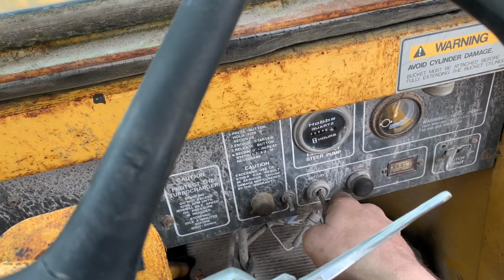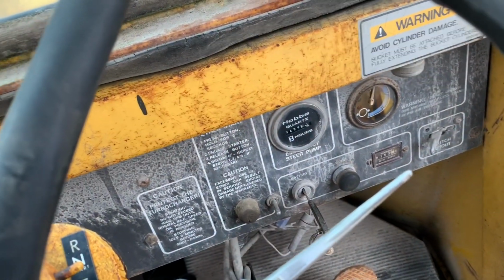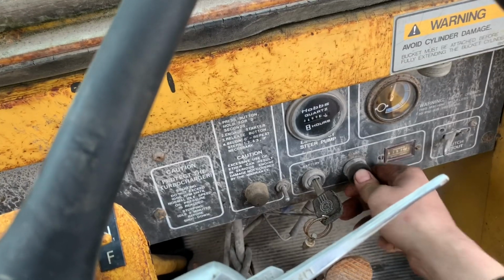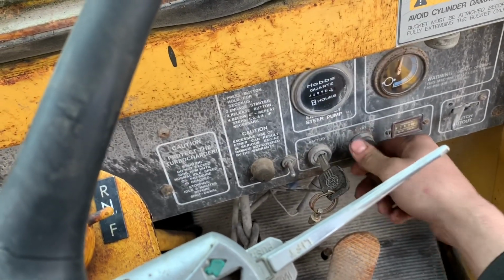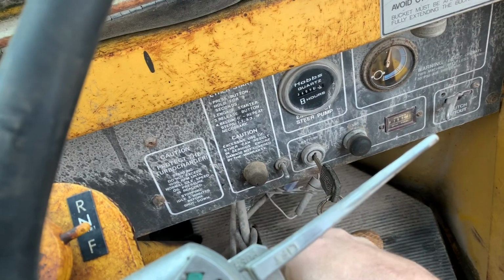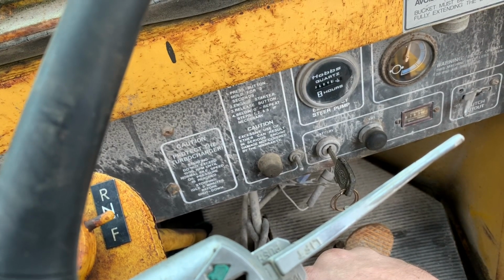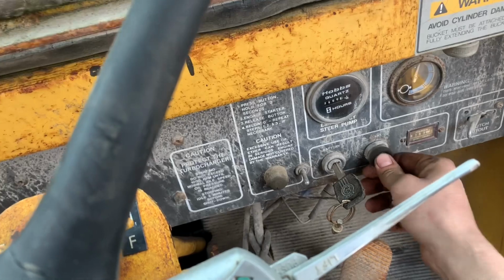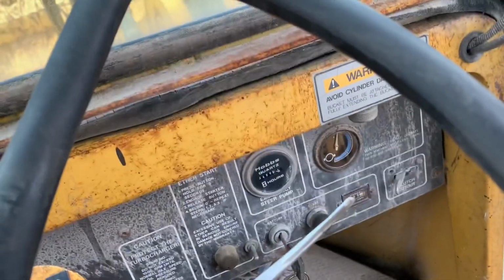Can you tap on the solenoid? All right, hang on. It's not wanting to. Can you wiggle the wires on it? Can you wiggle the wires on the solenoid? I'm not making a good enough connection. Or the solenoid finally just tuckered out. I'll get a jumper wire and we'll see if we can jump it from down there. Get this thing fired up.